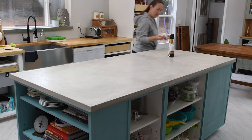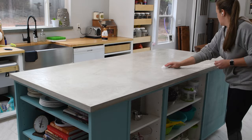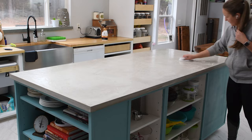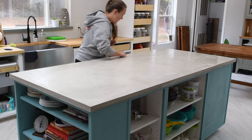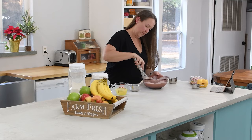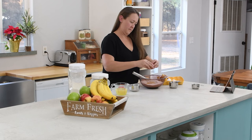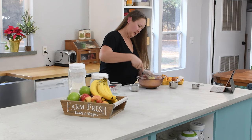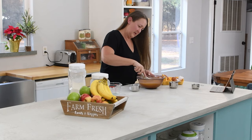Once you're happy with the sanding, give the countertop a nice cleaning, clean up the area, and let it cure. You need to let it cure for 16 to 24 hours before applying a sealer, so keep it protected from water, oil, citrus, and acidic foods for that entire 24 hours. After the sealer is dried it's all done. Looking back, it was such an easy project — I cannot wait to do more cement projects. The rapid-set cement really means you don't have to set aside a whole week, and the color is a lighter almost whitish-gray that is absolutely gorgeous. A huge thank you to CTS rapid set and their amazing reps who helped us create the perfect kitchen countertop.